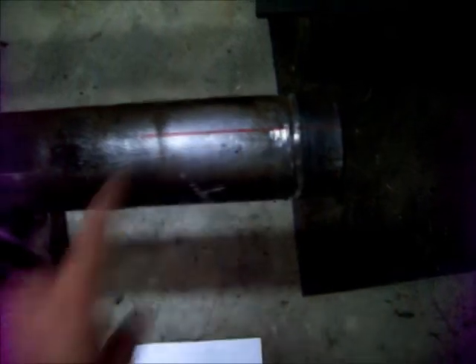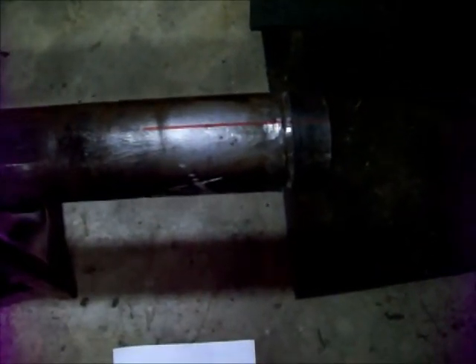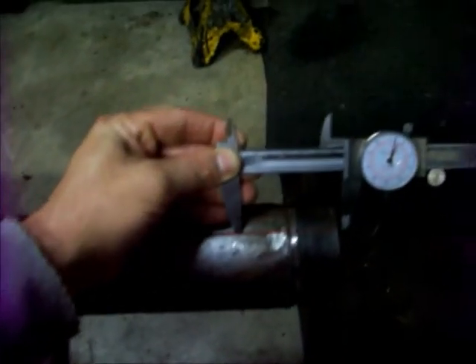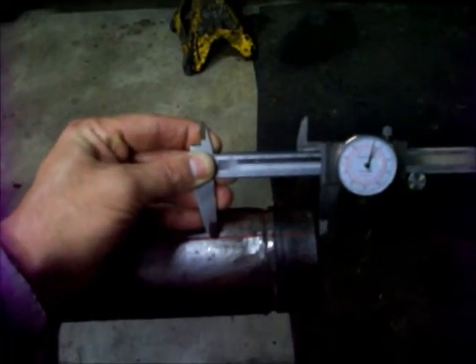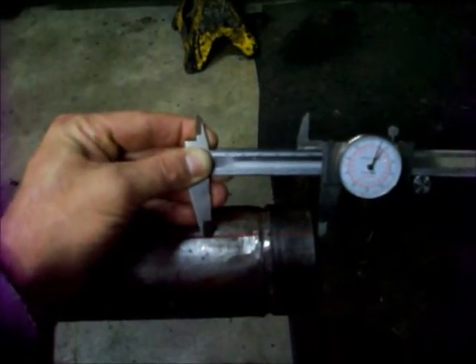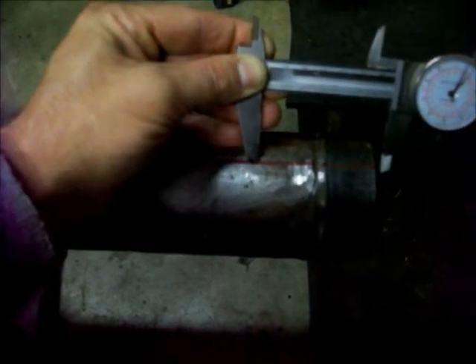I've laid out a straight line on there and then we measure 2.63 inches out and center punch our mark, and then we'll start doing the cutting. This is definitely a measure twice cut once procedure. I'm actually using some dial calipers here to get a precise measurement of 2.63 inches and we're going to mark it right there at that tip and then center punch it and use that as our line up point.